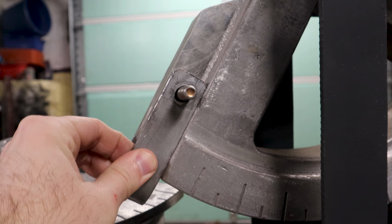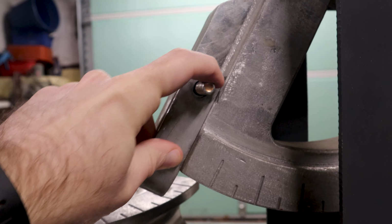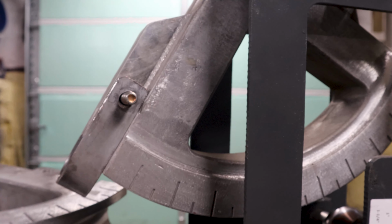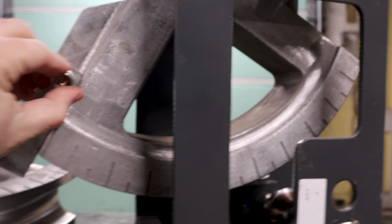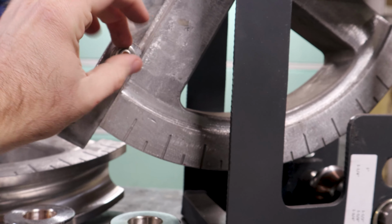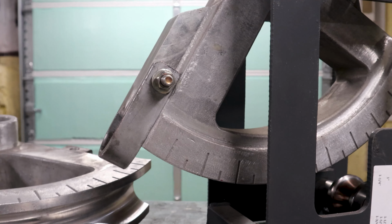And that could be from me bending that 120 wall tube, right? So that did wallow out a bit. When I put my first piece of tube in this thing, that hole seemed like it was too tight, right? Now, will that continue to elongate? I don't know. But it's something I'm going to keep an eye on as I use this bender.